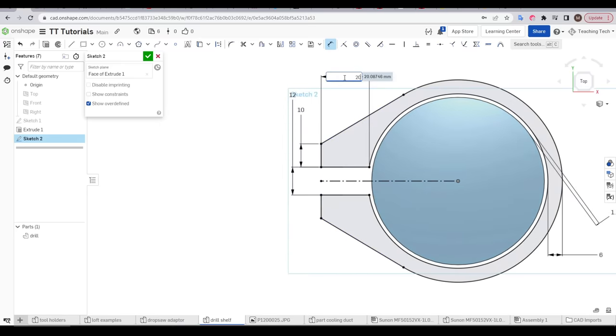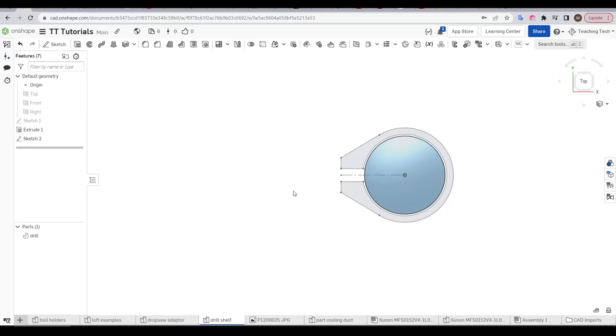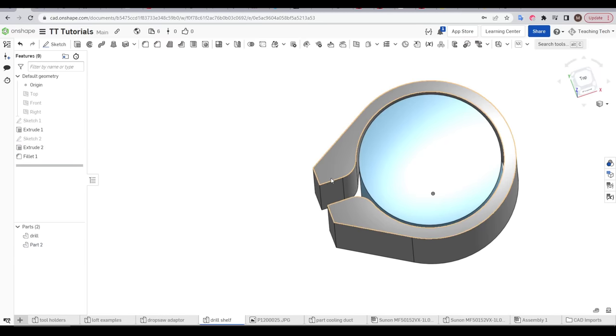The final dimension is for the width of the opening, and when I add this, everything is black and therefore constrained. What follows is a simple extrusion — I want this to be tall enough that two bolts can fit, so I go for 40mm. Finally, a fillet on the inner corner will help the clamp flex over the post. That's our basic part, so next up we need to add some holes and cavities for bolts and trapped nuts.